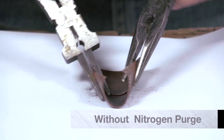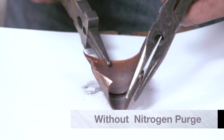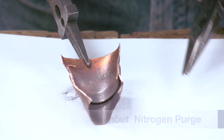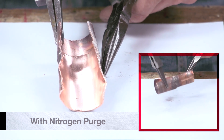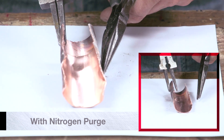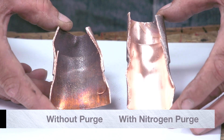There have been several incidences where the carbon will clog up the metering device itself. The tiny flakes going through the orifice inside the refrigeration system get clogged up in the metering device and make it fail. That's just one example of a contaminant inside the refrigeration system, such as carbon.